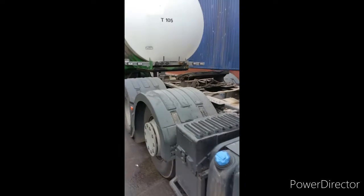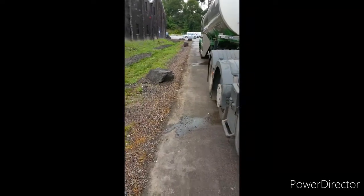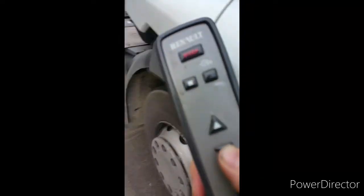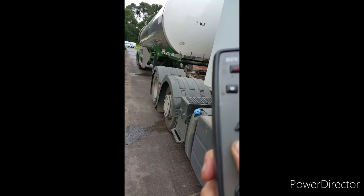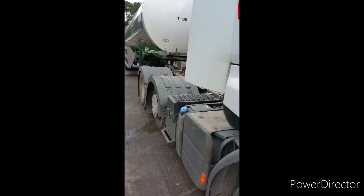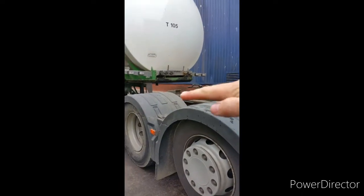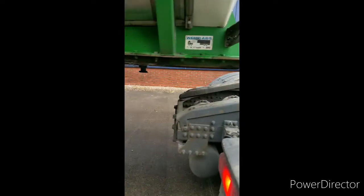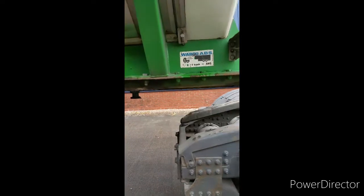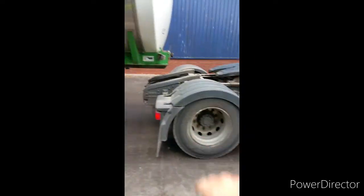Now I'm going to look at the height of the first wheel. She looks a little bit high there, so I'm going to drop it down a bit. Here's my remote — just press that button and I'll drop my suspension down a good bit. She should be about level there to go under. I won't be connecting then — I'll need to lift it up. I'll bring in the fifth wheel to about here, and then I'll be raising my suspension. It makes it much easier on the truck and on the fifth wheel itself if you take a bit of weight off.